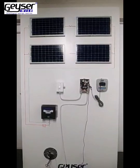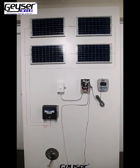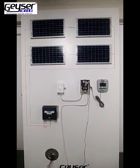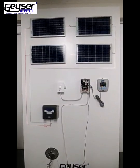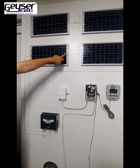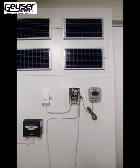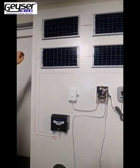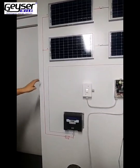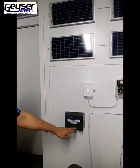In this part of the video we will be illustrating the DC connections for the GizaWise PV Water Heating System. If using 4 PV panels, the panels will need to be connected in series — series connection between 2 panels, and series connection between the other 2 panels. From there, you will run your red and black cables into the GizaWise MPPT Controller.